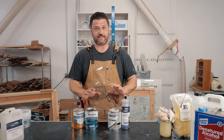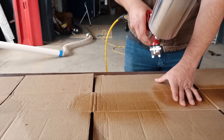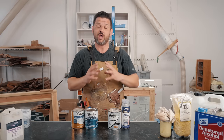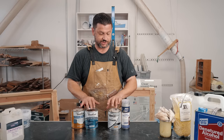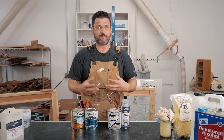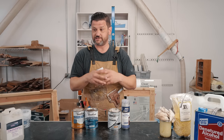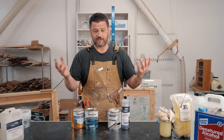I never brush these — I only spray them. I have an HVLP video which I'll link right here. You can get into HVLP for very cheap — my HVLP gun set was about a hundred bucks. In my opinion it's the only way to finish projects, because of the really high atomization — anything's going to dry really fast, especially these very fast-drying finishes. Plus you don't really get overspray. If you're wearing a respirator and goggles you can spray it inside because it dries before it hits anything else, and the really fine mist isn't going to get anywhere but your project.